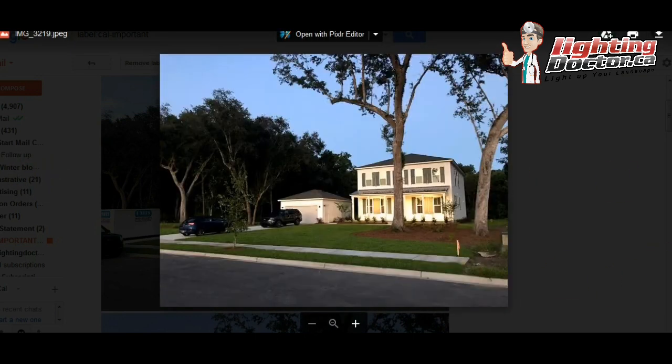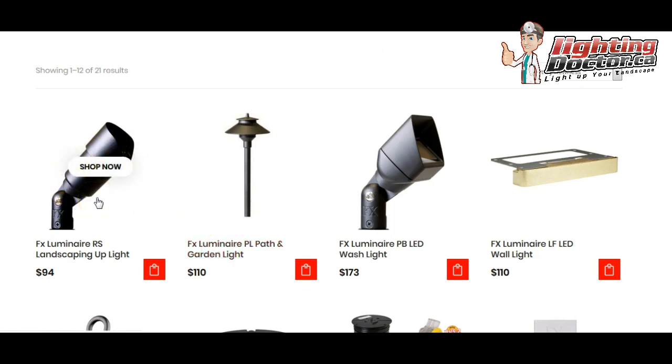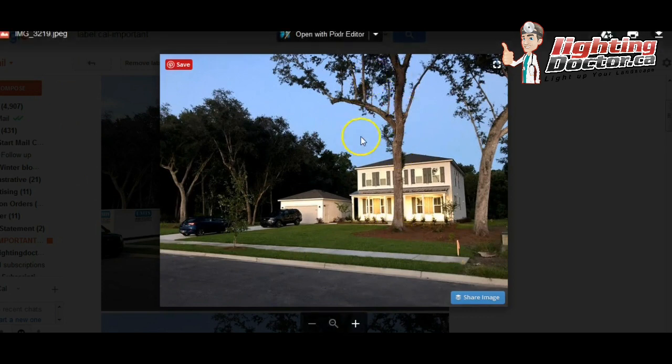Getting into the big oaks — I love the giant oaks you have on the property. I would have probably one to two accent lights down below, fairly close to the trunk, that really highlight the trunk and shoot the light as far up as possible. These use a standard 20-watt equivalent LED bulb — a 4.5-watt bulb with 270 lumens. But because the trees are so large, I would bump up to a 7-watt bulb, which is about a 50-watt equivalent, and narrow the angle of the bulb — say 15 degrees as opposed to 35 degrees — so the light shoots even further up.